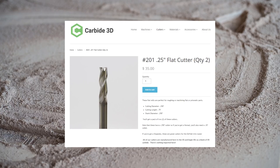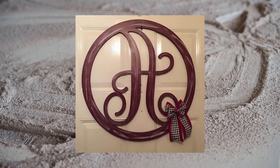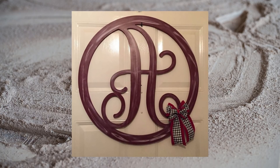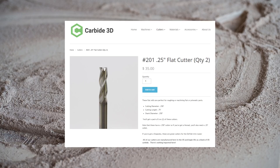If you've purchased the Shapeoko 3, your machine will most likely come with a 1/4 inch square end mill. The 1/4 inch refers to the cutter diameter, and the square means that the end of the bit is flat and perpendicular to the shank. 1/4 inch bits are quite sturdy — there's a lot of metal there to resist bending and breaking, and they can be run fairly aggressively through most material. Material 1/4 inch or less can often be cut in a single pass, especially with softer woods, MDF, and plywoods. If you're planning on making larger items such as monogram door hangers, you may find you almost exclusively use this size bit. The 1/4 inch bit you receive with your Shapeoko 3 should last you a long time and make a lot of cuts.